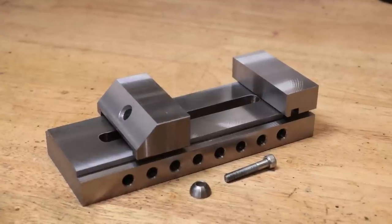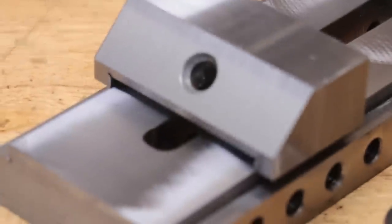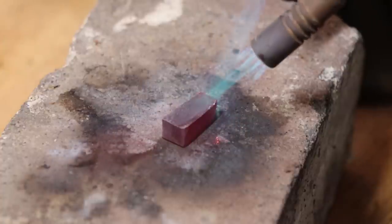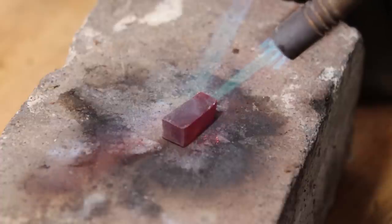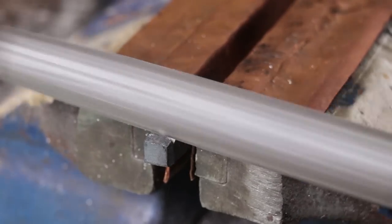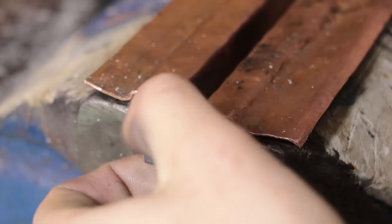In this video, I'm going to attempt to heat treat and harden the parts. The steel is relatively soft, and even during the light machining of that part, it picked up quite a few scratches and dings. However, as I demonstrated at the end of the previous video, you can't harden this steel using the normal heat and quench method. The problem is that there just isn't enough carbon in the steel to harden it using that method, so the simplest solution is to go ahead and add more carbon to the steel, and then we can heat treat it.